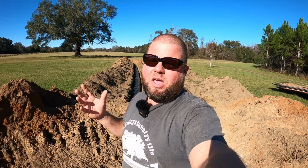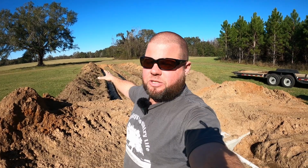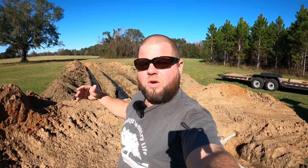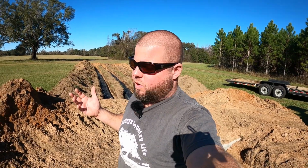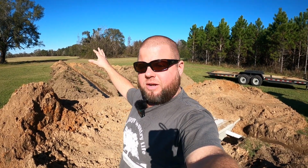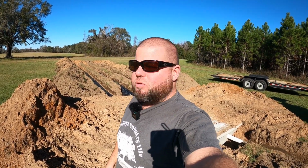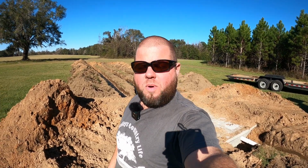And then they tell you, hey, you need a certain size tank, certain size drain field. Ultimately, it's the drain field that truly matters for your certain heated and cooled square footage. So I needed what was called 375 square feet of drain field. That's the actual percolation out there, 375 square feet. I think that covered me up to, I don't know, 17 or 1800 square foot home. We have a 30 by 50 or 1500 square foot heated and cooled. They don't do open porch area.